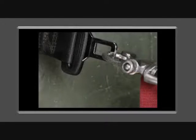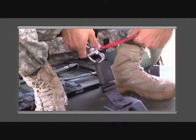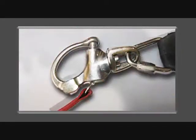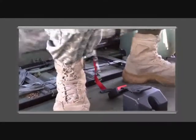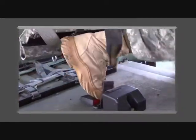Failure of the GRS has been caused by unauthorized modifications and improper connections. Many soldiers are using the emergency release strap to exit the vehicle during normal operations. Increased use of this strap causes the quick-release swivel to bend and wear prematurely, making it unserviceable. When the emergency release strap is used improperly, the push-button quick-release is left on the floor and is often damaged by soldiers stepping on it while exiting the vehicle.